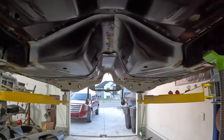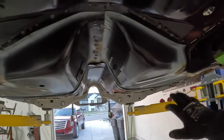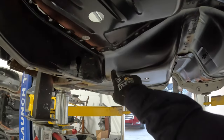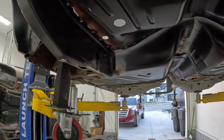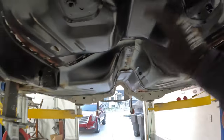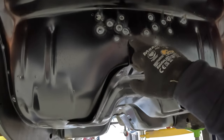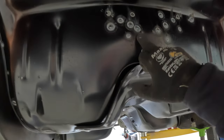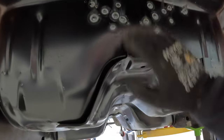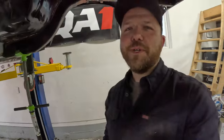Looking at the bottom side of our rear footwell panel, you can see my overspray for my weld-through primer, but where the front of my frame rails are, we've got a nice tight fit on both sides. We've still got some cleanup to do here once I get the car on the rotisserie and flip it upside down. Every single panel where I test fit everything, we're going to have these screw holes that we're going to have to go back through, dress out, grind down, and clean up so we can move this thing onto bodywork,